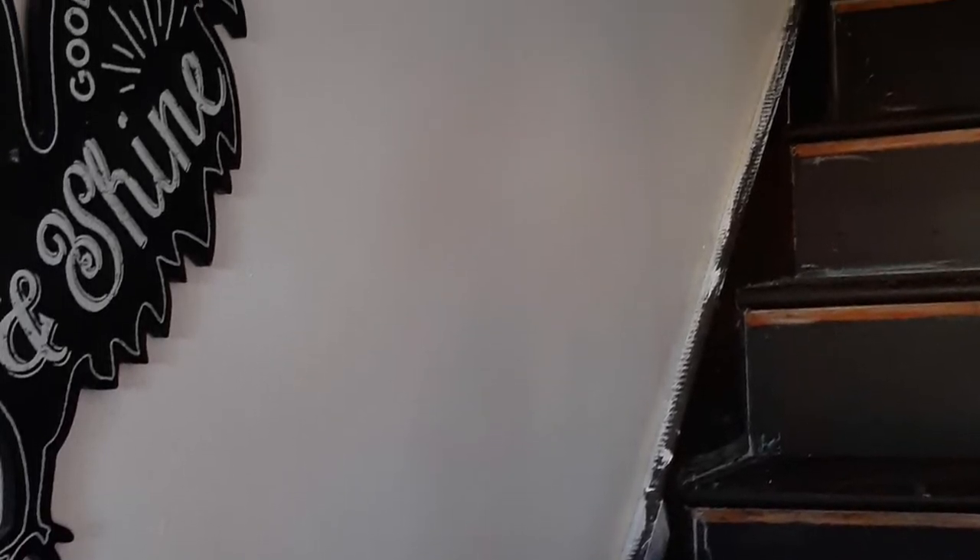So what I ended up doing — I'm looking all around — it's like these stringers aren't moving up here. So I took off the one piece of sheetrock which was on the right side of the wall going down the stairs. See those studs? That stringer was not attached to any studs. There were nails shot in, but they would just miss the studs. So I just screwed the stringer into the studs. That one side was just floating.